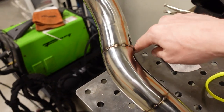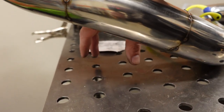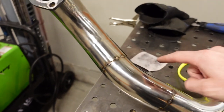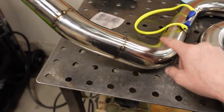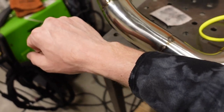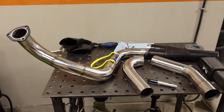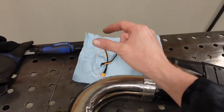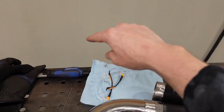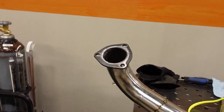Also, I did have a little kick here for the oil filter. The oil filter will sit down there like that, so you've got plenty of room to change the oil. And then the pipe stays very, very close to the transmission bell housing because out here you've got a drive shaft, and you don't want the drive shaft to hit the exhaust. So that's the shape that it's going to take. On the passenger side, it'll be a pretty simple jog in slightly, jog up, and then another final twist to get into the header.